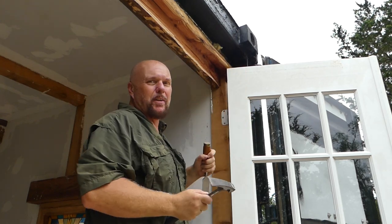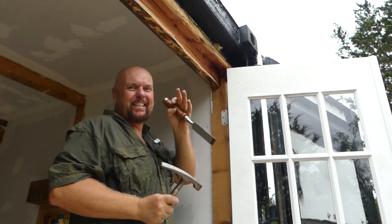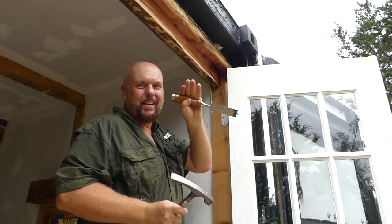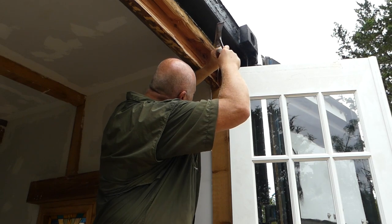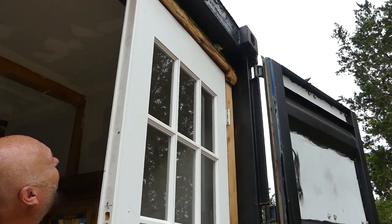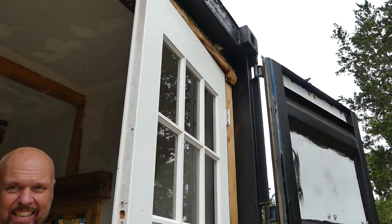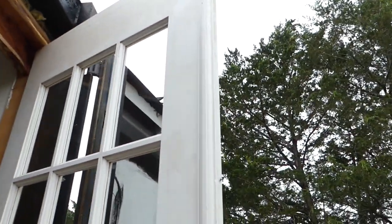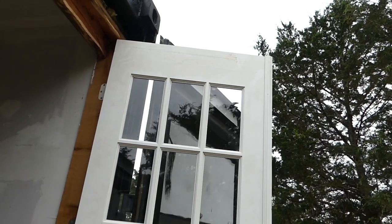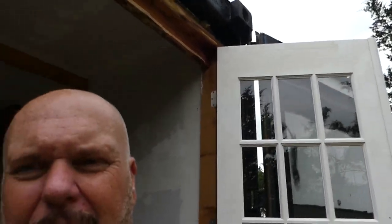It's the knots in the cedar, they didn't come out as clean. So wherever I find them, I've got to clean them up later. And then the door will close correctly. All right, my goodness. I'll show you where it hits from where I carved out that little notch too, that relief. Look, boop, that's not half bad. I'll do just a little bit more work on that one too. For eyeballing it, my first rough in, not bad at all. Get the rest of the hinges on and then I'll be back to you.